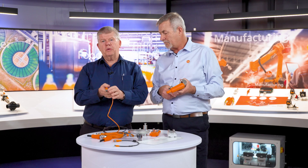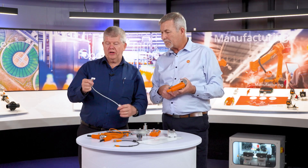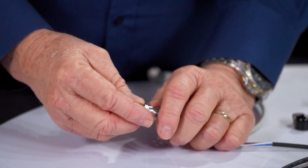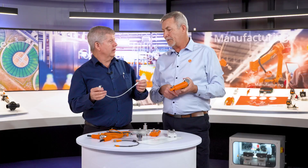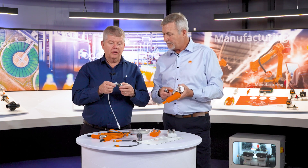Terrific product, food and beverage related, that type of environment. And the newer one you'll see on the website now is our new EVF food and beverage cable. That's a really important material for applications where there are materials that could cause corrosion for PVC, like oxidising agents, acetic acids, those sorts of things. It's great for wash down, especially when there's high pressure, caustic wash, food and beverage, anything to do with that type of manufacturing. The locking mechanism holds it in place and stops it from coming loose.